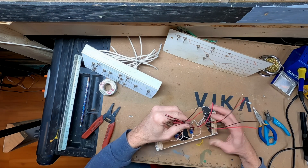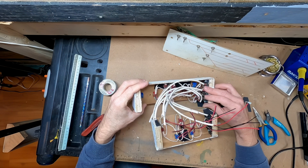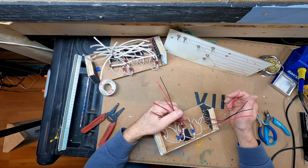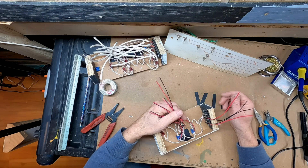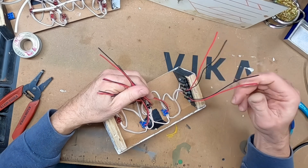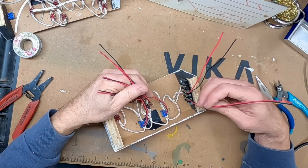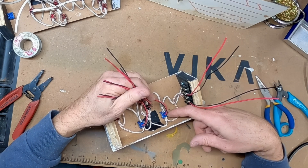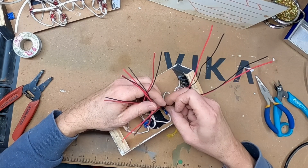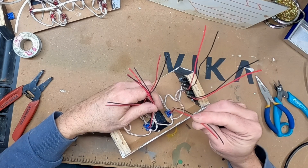With this panel when I built it — and I'm going to do something similar with the new one — if you notice on both of these I have a terminal block on the back and then the power feeds going to the switches. The way I'm going to wire my layout, I'm going to wire it to be ready for both DC and DCC. I'll have one set of power feeds coming in from my DC power supply, and a second set from my DCC power controls. Each double pole double throw switch will be supplying power to a section or block of track, and with the switch I can select whether I'm powering that track with DC or DCC.